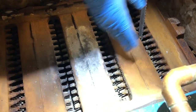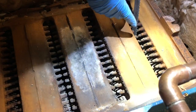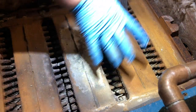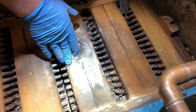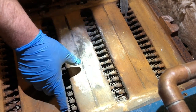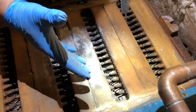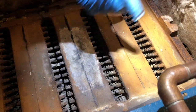Here in the front of the boiler — remember at the back we had a target wall to watch out for — on the front of the boiler we have the burner, and the blast tube comes down inside the combustion chamber. I find it best to do these boiler services when the boiler is nice and hot. It helps the soot fall off — it's more brittle, more dry, and just kind of flakes off like dust. If the boiler is cold it can sweat, and then the soot is caked on and will cake up the brush. I recommend turning the boiler on, getting it nice and hot, making sure it's nice and dry inside with no condensation. But don't ever forget to turn off the boiler before you start pulling it apart for maintenance.